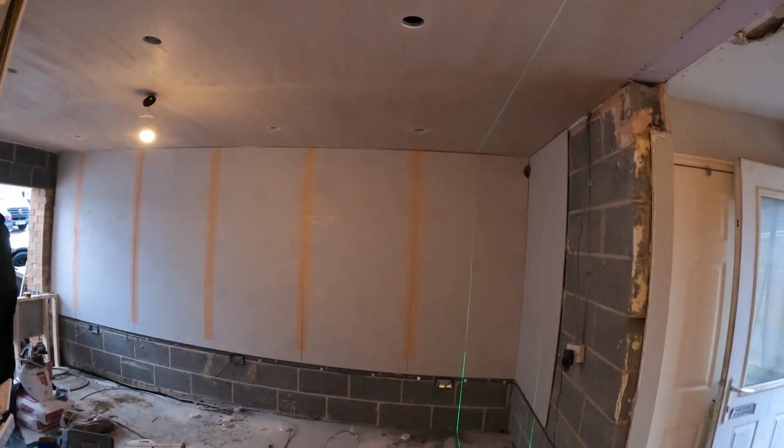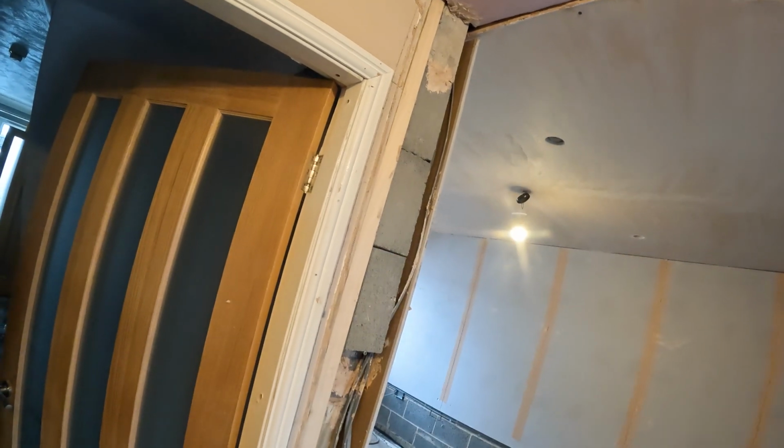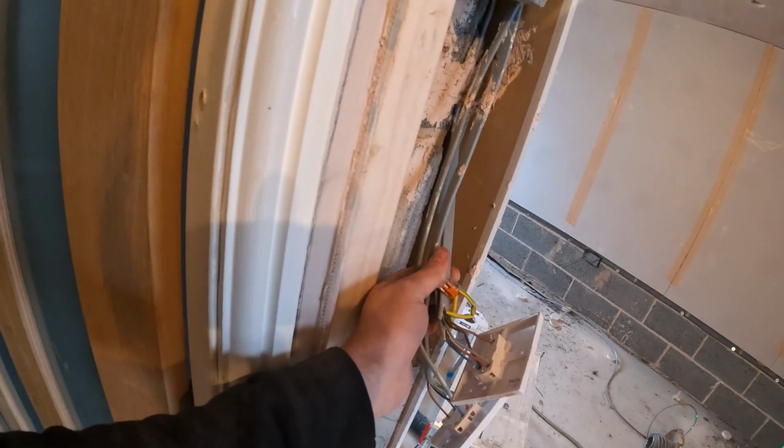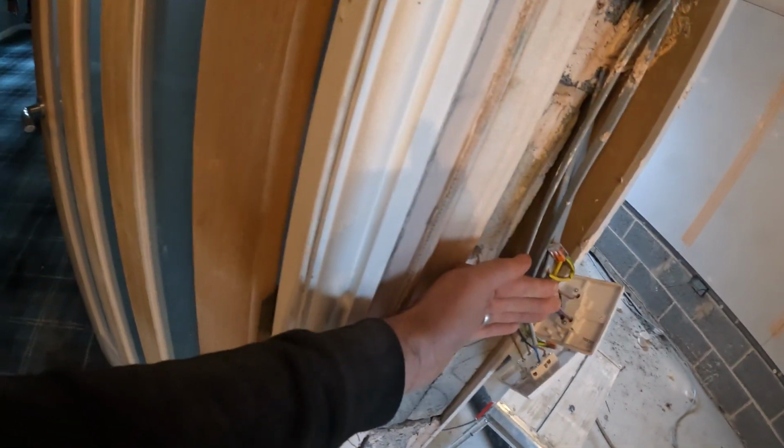Now that's these downlights all cut out then, ready. So we'll go upstairs and get the carpets up, get those cables. So we'll have to extend from this light to each of the 8 downlights. This switching we'll have to disconnect the 2-way, bring that into a 3-gang into here. So that's the next job.